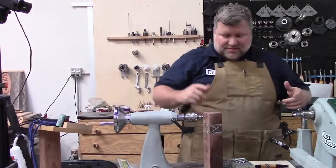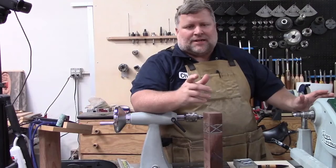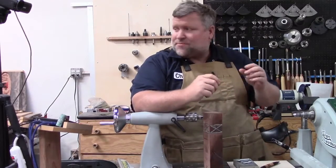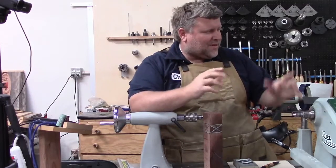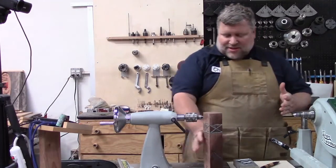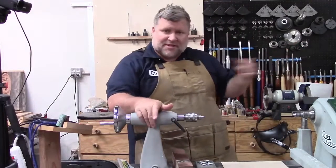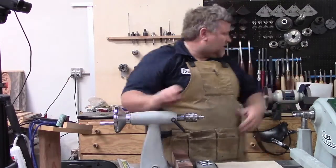Making this, you can do it a variety of ways. The first few times I did it on the table saw, and that works fine. Lately I've been using the chop saw, and I'll show you what I'm doing. But the trick with pen blanks is they're kind of small, so it's dangerous to make angle cuts on a small blank with your fingers so close to the blade. I kind of made up this little hokey jig that helps do that. So we're going to glue one up, then I'll show you what it looks like, and then we'll turn it. There'll be some switching back and forth from the saw to here when I'm gluing it up.